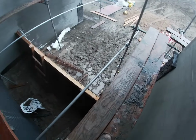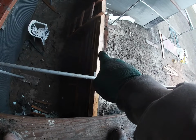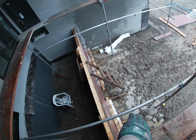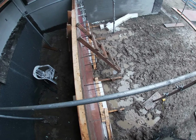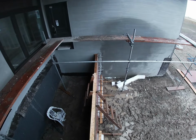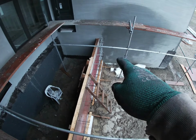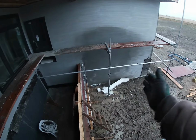Let's go have a look. So this is more of a conventional kind of wall with what they call snap ties. They poke through on the backside here and they slide the rods through holes. And then tomorrow, I imagine they're going to come back and there's going to be rebar in here. And then they close up with another form on the other side and slide rods through those little holes there. That's what holds the form together, just like the webs do on the ICF forms. And then there are those comically big bolts I stuck in there, those 1-inch threaded rod bolts that go right into the column that's underneath this beam here. That'll hold this concrete wall from tipping that way.